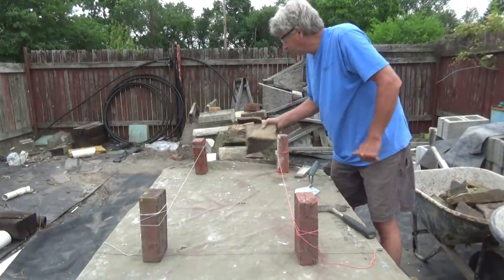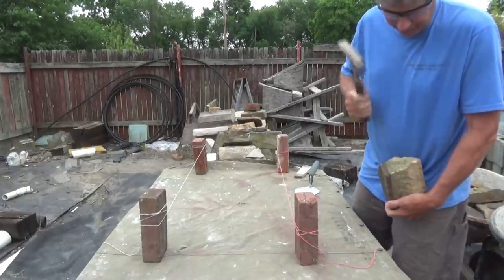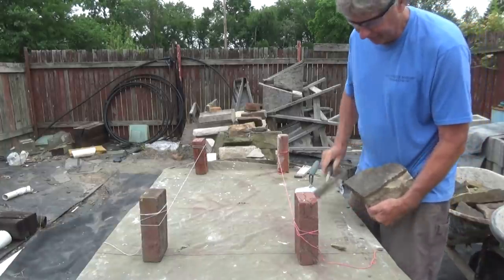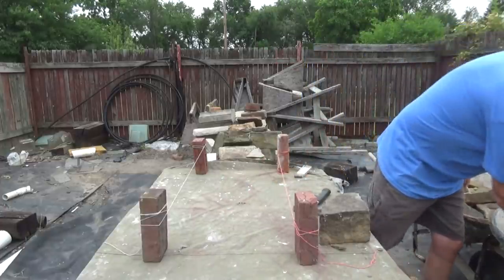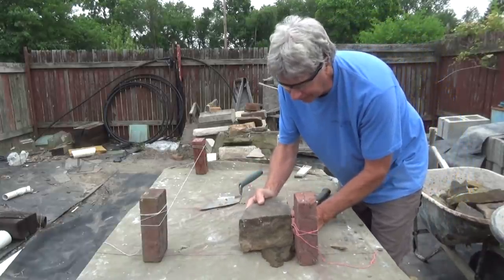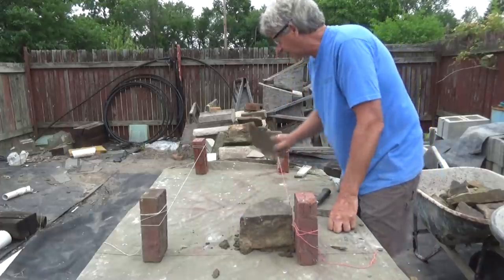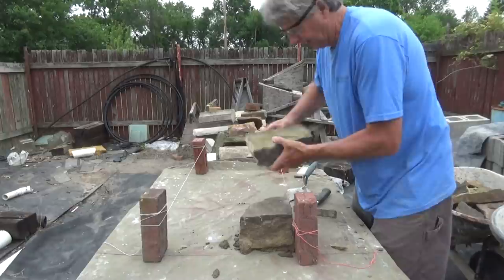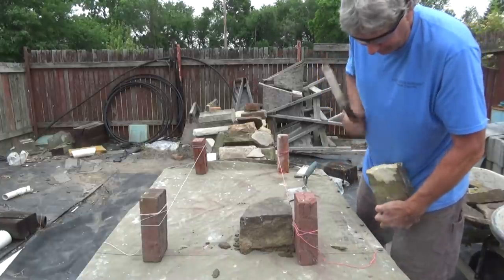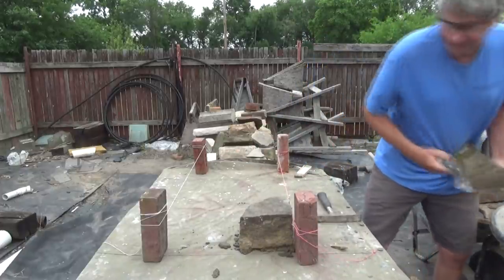We're going to start out with some stone, and anytime a mason wants a little corner there, they want to go as close as they can, and they want to trim that stone, so they use the least amount of cement as they can. So if we're going to pretend that this is a rock, we're going to put some lime mortar down, because in them days that's all they had, and we squish it down, because the less lime mortar we got, the better off we are. Remember I told you, if something stays there when it's dry, it's going to stay there when it's wet. Now here's another one. Look at that, not too bad. And I guessed at that one. So we're gonna put that one in. We trim it up best we can, because we're gonna cover this whole thing with a plaster.